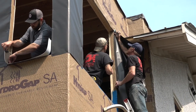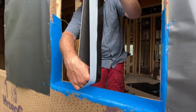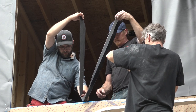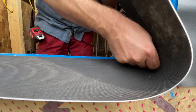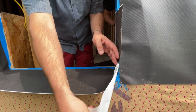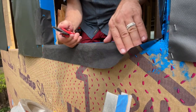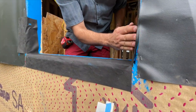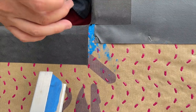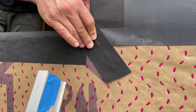Following Saul and Steven is Michael, who's covering the liquid applied flashing with a UV resistant flashing tape that's part of the InvisiRap UV system. He begins by finding the center of the flashing tape and sticking it to the center of the window opening. For wide windows, use the buddy system. Extend each edge to the side jamb, tuck the tape tightly into the corner, and then stick it up the jamb. Now we're ready to remove the second release sheet and fold the tape into place. Because it's not one of those fancy flexible tapes, you need to make relief cuts at the corners and then cover the corners with a patch. If you cut just shy of the actual corner, you can bend the edge of the tape over the vulnerable spot. The jambs are folded over the InvisiRap and the corners patched — now the vulnerable point is triple protected: the liquid applied flashing, the flashing tape bent over the corner, and finally the patch.